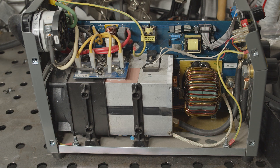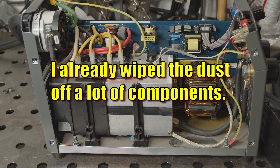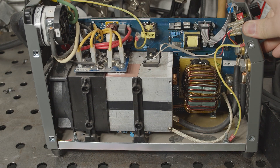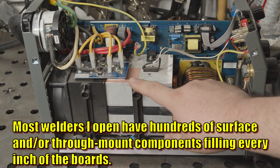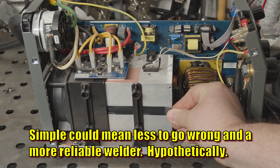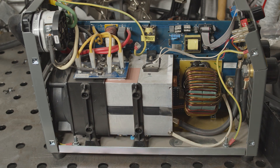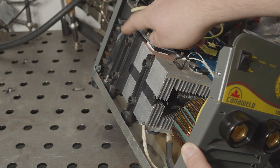Having a look inside the welder, the very first thing I noticed is that it is awfully dusty — this thing must have sat in a warehouse for a while. But overall it's actually like the outside: a very simple, basic kind of design. Not really a whole lot to it. All of the main IGBTs and the rectifiers are all bolted to these two heat sinks. These are actually separate heat sinks — you can see there's two separate heat sinks and they just have this divider here to keep the air inside, making a wind tunnel design. And you can see kind of the opening in between the heat sinks, and there are actually four capacitors in here.